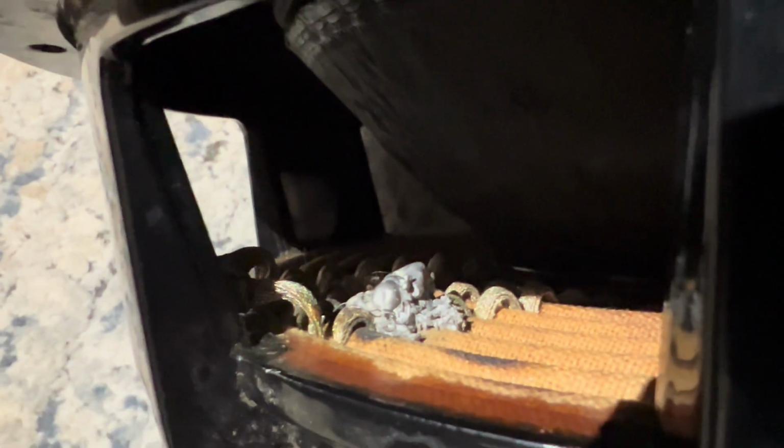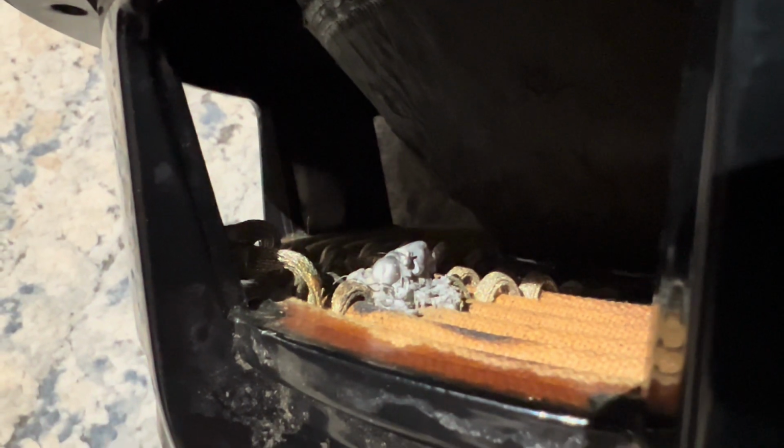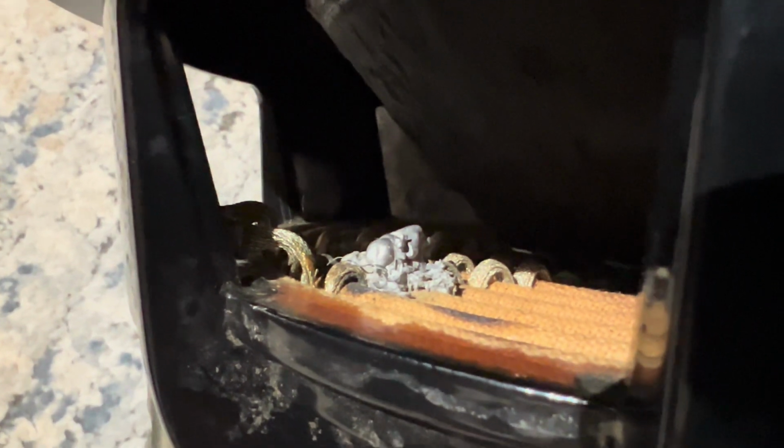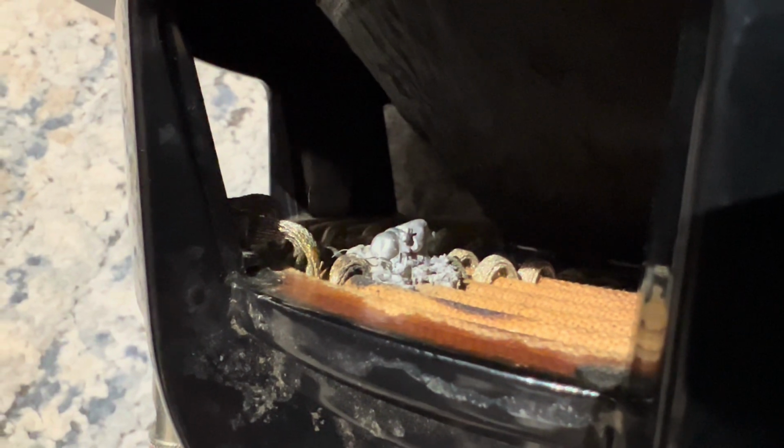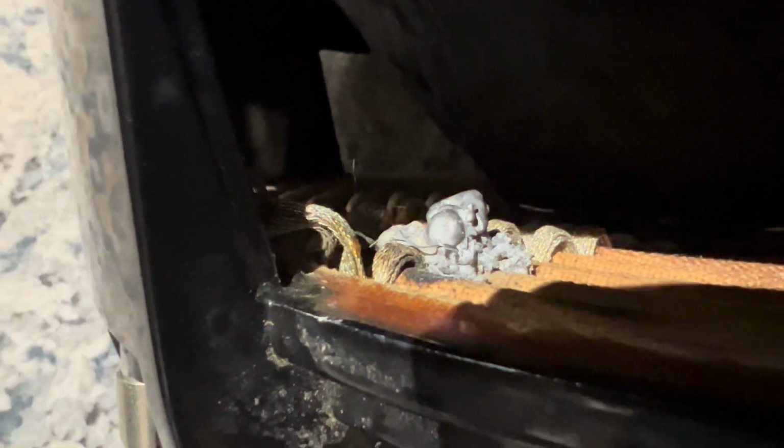So I don't usually see this. In fact, I've never seen this. Usually when it's gotten to this point, that means the voice coil is burnt out and you're running so much current through the tinsel leads. And you usually don't see it discolored in the center, right? You'd see it discolored at the very ends, or it propagates from one end to the other. So this was really weird. As you can see, double braided stitched tinsel leads on this end.